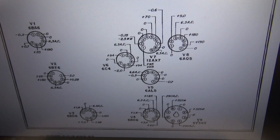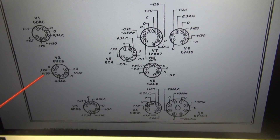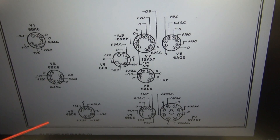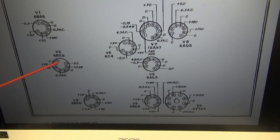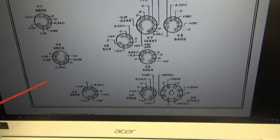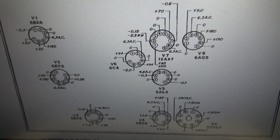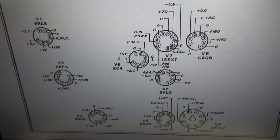Here's the tube voltage chart, and pretty much all the high voltages are fine - 150 volt, 190 - all those are pretty close to tolerance. But what I did notice was, like this pin 1, negative 2 volts; over here there's 1.4 volts - those voltages are pretty much at zero. So there is something wrong, just haven't narrowed it down yet.